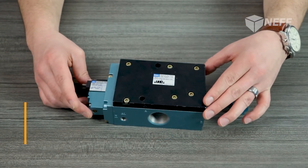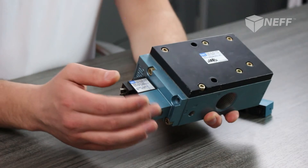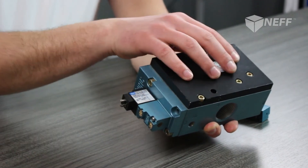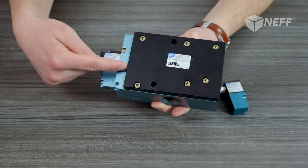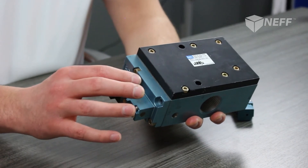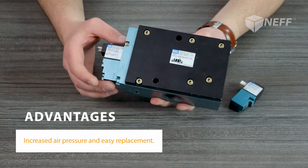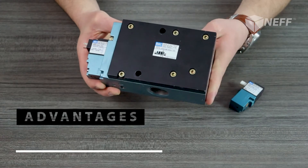Let's talk about a pilot valve. This valve has what we call a pilot valve attached to it. The pilot valve has all the main components of a valve we've discussed — a solenoid, a connection, and some sort of valve body. The difference is that this valve is used to drive a larger one. When the armature is engaged via the electromagnet, we allow air to flow into this valve, acting on the main spool and driving it back and forth. The advantages of using a pilot valve, as opposed to a direct-operated valve where the solenoid drives the spool, are that you can get much more force by allowing air pressure to drive the spool, and often for maintenance reasons you can replace a pilot valve much more easily than unplumbing an entire larger valve.